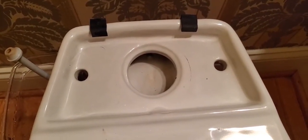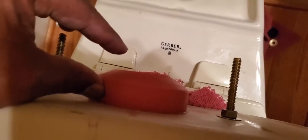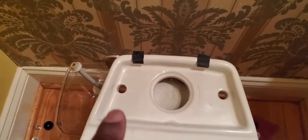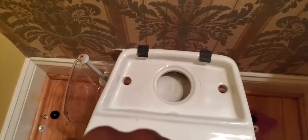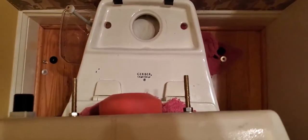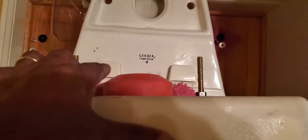When I first removed this, the spacers were located right there. I went back to the store and got another seal that's about this thick for about $1.99, and it actually worked a whole lot better. As soon as I put it in finger-tight, one turn on each bolt, with the spacers in, everything worked — no leak at all. Fluidmaster does a really good job overall, but you won't discover this problem until about 10 o'clock at night when you can't go to the store until the next day.